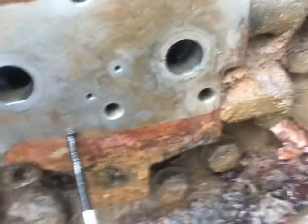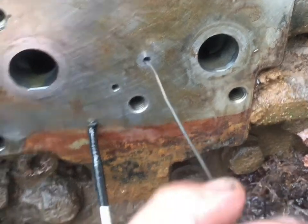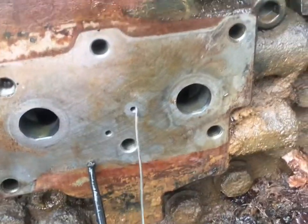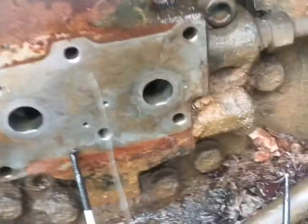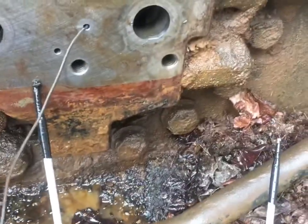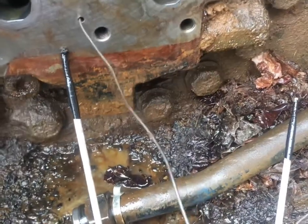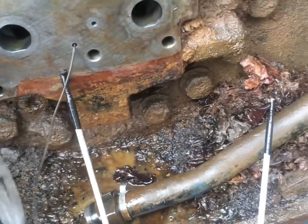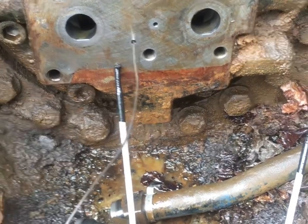This port goes in and I can feel it's open all around — left, right — I can move around in there. That goes into an open space like a case, the case of the motor. But this other port: going in on the side — nothing; other side — nothing; going up — nothing. But if I go in straight down, there's a port that goes straight down. So this one is cross-drilled down.